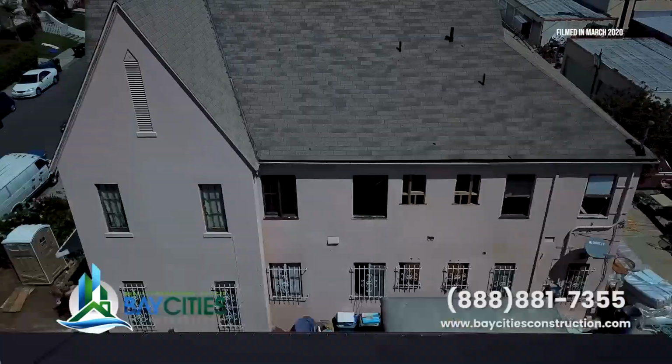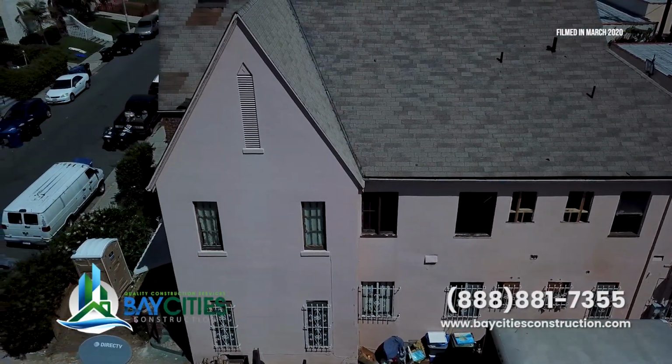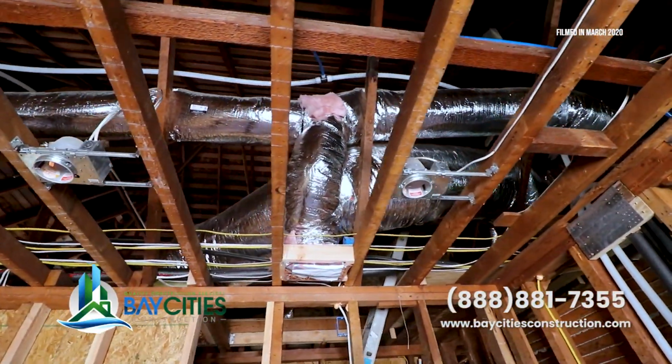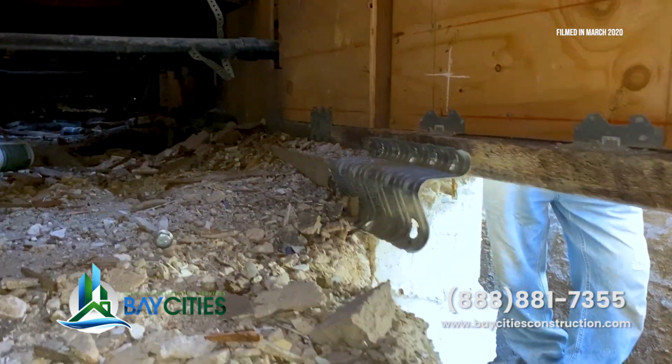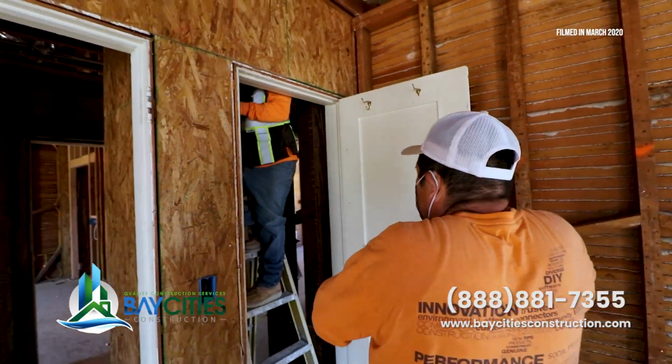See how big this house is? Like, it's a 2-story deal. This house weighs more, I think it's 800,000 pounds. I did the math on it. So we're actually here in Koreatown, expansive soil. We're near kind of a high risk area. So we had to do a lot of definitely structural one plywood and a lot of bolts. This is some of the stuff that we're doing here, but we started with the retrofit work first because once we cover up the floor, it's gonna be a lot harder to do that.